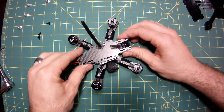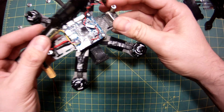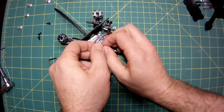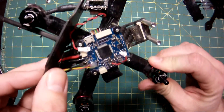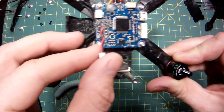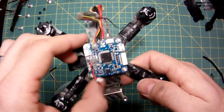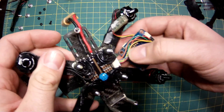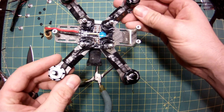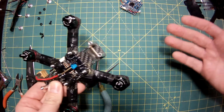Now that the top plate is off, you can see I hot-glued the antenna to the top plate here. Check out how I built it — there's some hot glue in there because the whole UART port ripped off, so I had to solder directly. And for the FPV all-in-one camera, I just hooked it up with a disconnect. You can tell it's conformal coated — waterproof. All I did to power the camera and the VTX was solder in a positive, a negative, and a connector to the flight controller's 5-volt rail with ground — super easy. The all-in-one ESC just has this one connector, so I can pop this out and the flight controller comes right off. The Racer Star 4-in-1 ESC has been awesome for over a year — that's the reason I didn't want to buy a 20x20 stack. This stuff works great, flies great; I just want a little better FPV experience.